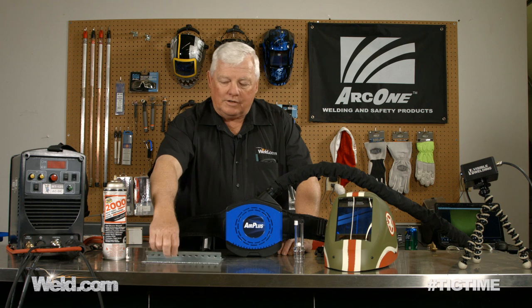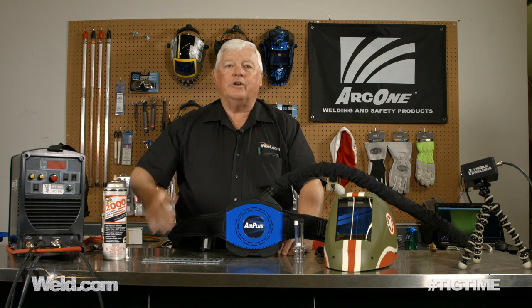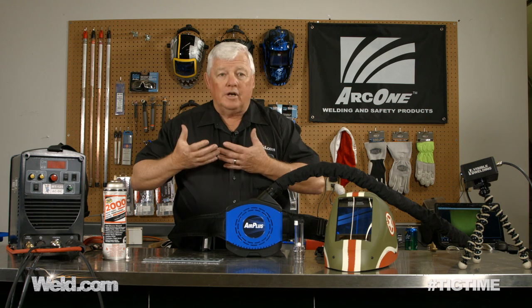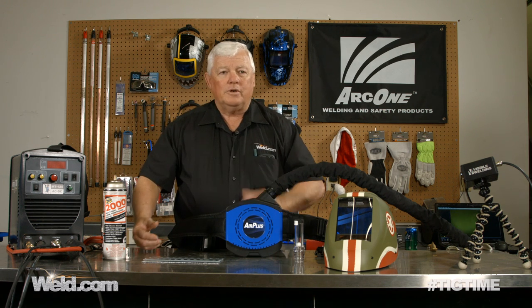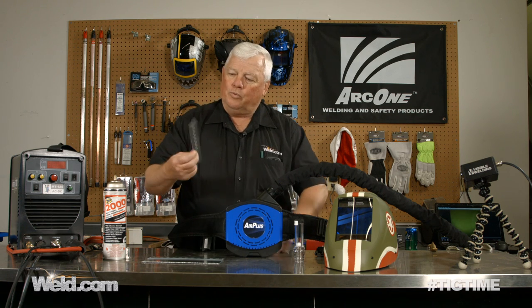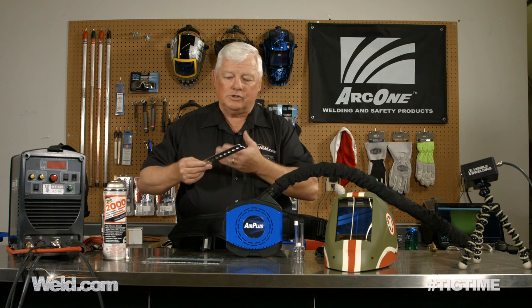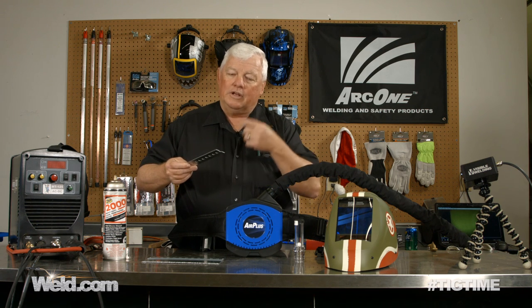I've got some brackets here that I got down at the hardware store. They're cadmium plated. Is that cadmium hazardous to my health? And the answer is yes. In many cases when you're in an outside environment, your hood covers everything you need, but in this particular case we're going to show you that it doesn't. The question is, can't I just grind off the cadmium or galvanize? Well, anyone that's ever done that knows it's just a coating — you just can't get it all off. So when you're welding, you can see all this crud and corruption coming up.